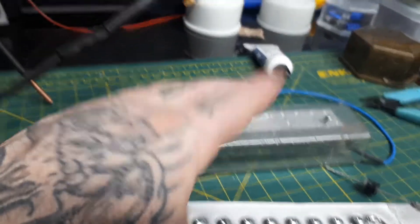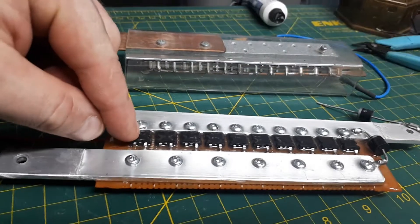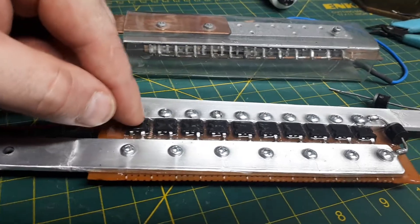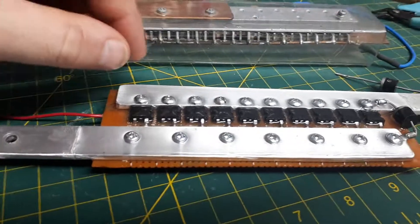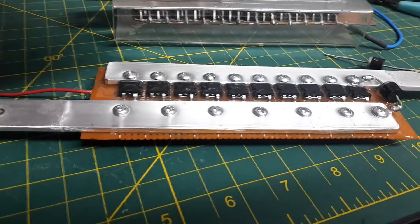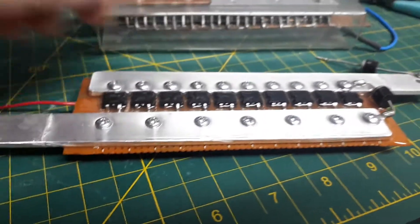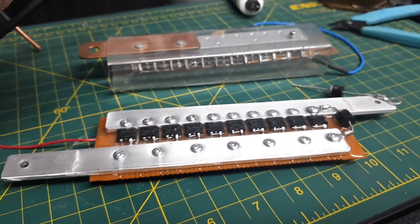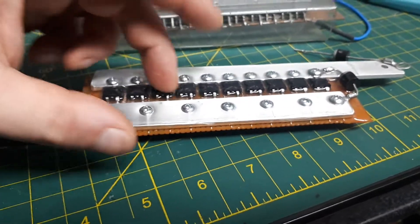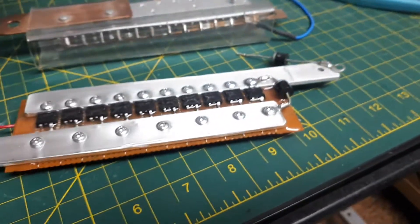First, I tested and blew up a couple of spot welders using no diodes at all, then looked up why that happened. Basically, a MOSFET is a diode by construction, but these internal diodes have a breakdown voltage — a limit before they damage themselves. Using a MOSFET as a diode is essentially breaking it down, same as using a diode to block.